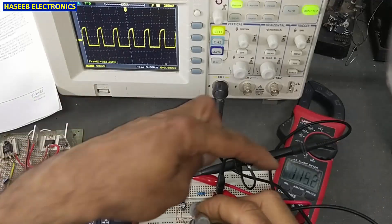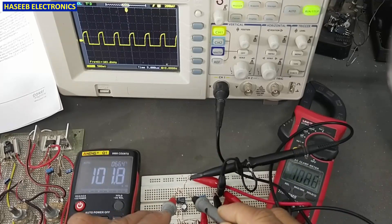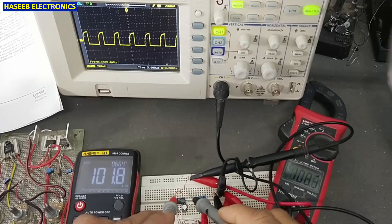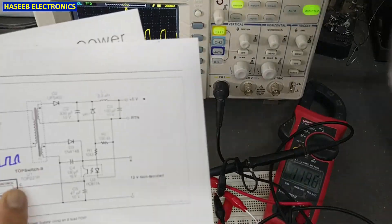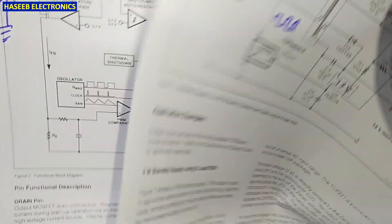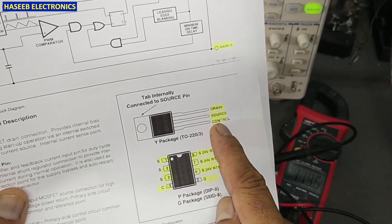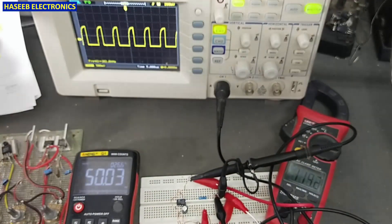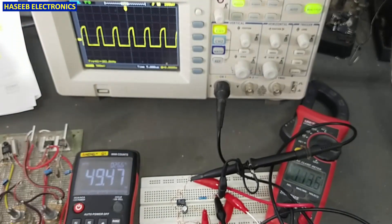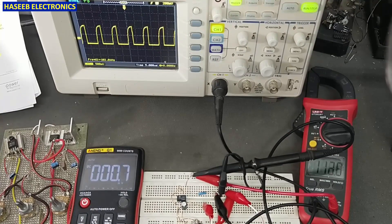The oscilloscope is showing 102 kilohertz, and here it is giving 15 kilohertz on another channel. The multimeter has confirmed 101 kilohertz. So in this way we can verify the function of these ICs. Whether it is a 3-pin or 8-pin package, the control pin receives 4.7 to 5.7 volts and maintains switching at 100 kilohertz — it is a fixed-frequency switching IC. I hope you enjoyed this video. If it was informative, please hit the like button. If you have any questions, kindly write in the comments. Thanks for watching. Assalamualaikum warahmatullahi wabarakatuh.